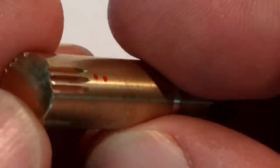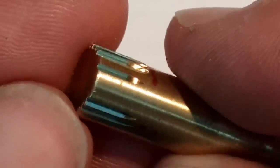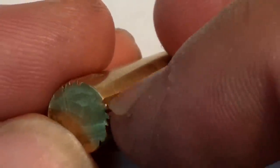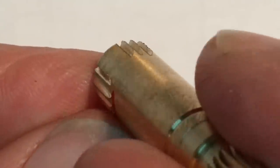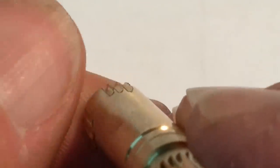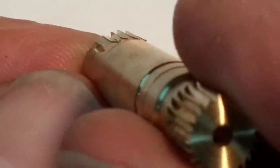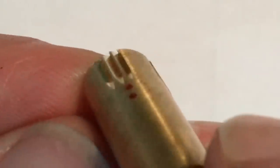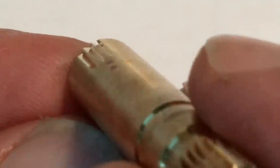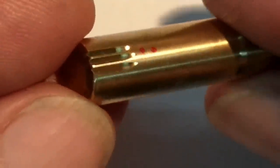These are the teeth that I just experimented with using the cutter, and you can see how it forms the shelf it's supposed to form without the burr. Now that's what we're going to talk about right now — the burr. You can see how this one raises up, and how this one raises up as well. See how the material displaces around the cut — that would indicate you've got some drag going on with the tool. This one is just atrocious. But on the one that was relieved correctly, you've got almost no raise, no elevation, no displacement of the material. That's what you're looking for.